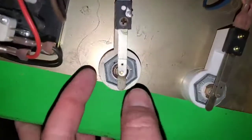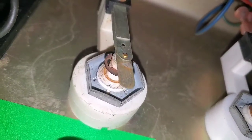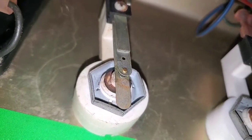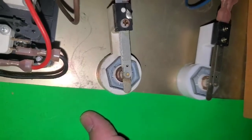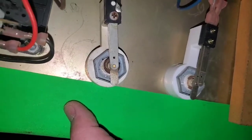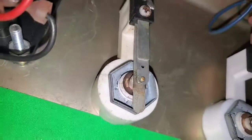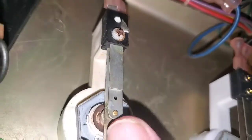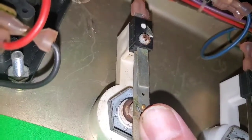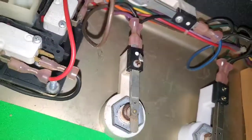Now, in very rare cases in an early 80s game, you might have a switch that looks like this — a leaf switch. When the button's pushed, you'll see that the contact is made. That is the way those switches work. It's just a common, and then it's a fire button or a pass button or whatever it is. You have to look and see what wire needs to go to this particular button of your game. If it's not working, look at the wires, make sure they're connected. Sometimes on the leaf switch micro switches, these get a little dirty because they make contact and there's usually a little spark. So you get a little piece of sandpaper, get inside here, clean it out, and make sure they're connecting when you push the button.